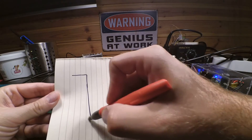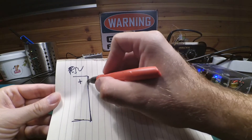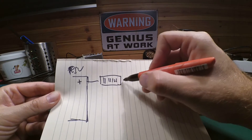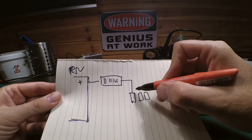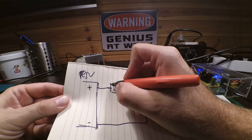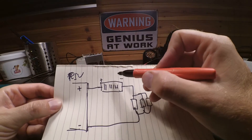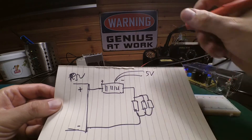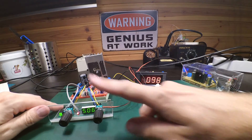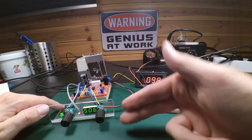My power supply unit - positive goes out on the yellow cable to my amp meter with the number display, then to my load which is three resistors in parallel, and then back to minus. On the amp meter, this is marked plus and this is marked minus - nothing strange. Then I have my other power supply here feeding the 5 volt supply for the current meter. I have turned the voltage all the way to maximum and the red LED is on for my current limitation, which I have set to 100 milliamps at 5 volts.